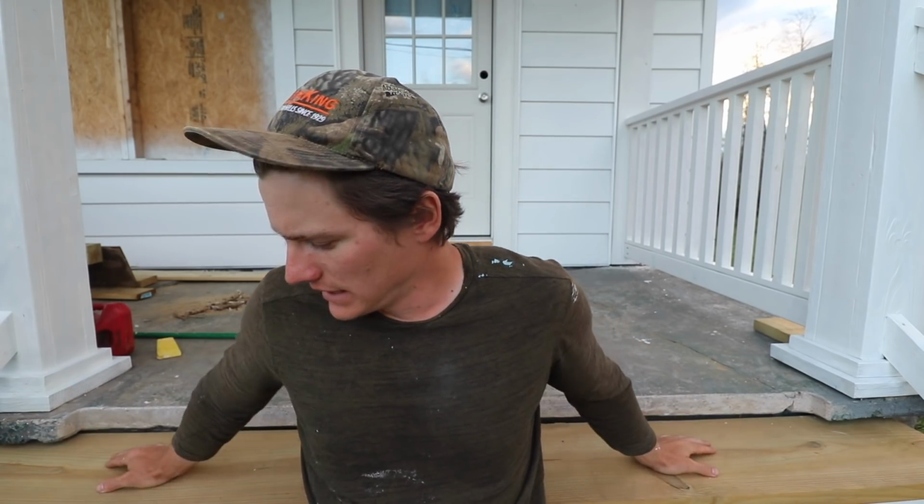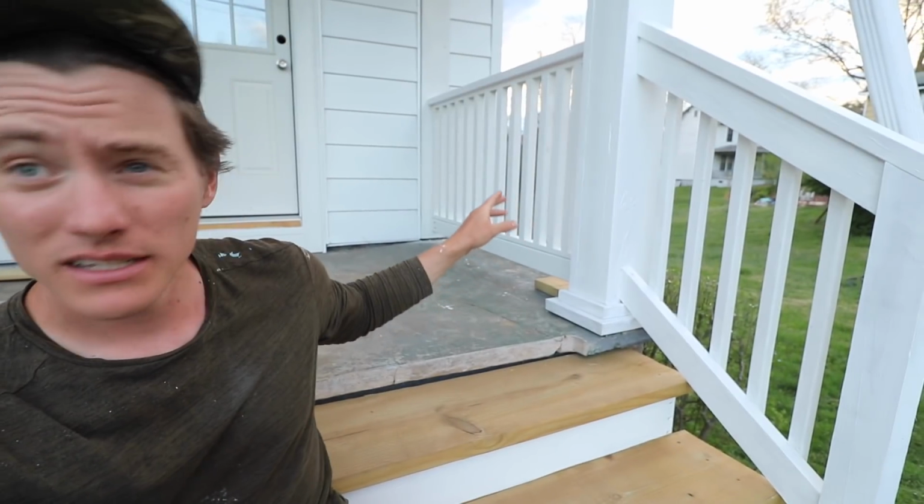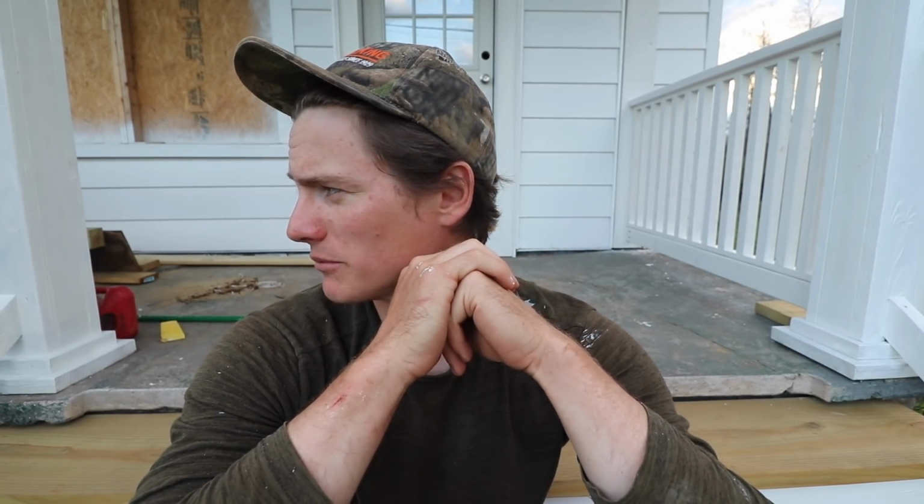Other things I'm going to do is probably put some sort of a stain on the steps themselves, so the kicks are white. And of course that stuff's going to get dirty. And then if you look at some of the paint job, you'll kind of see that it's a thin coat, but it's a solid stain. It doesn't require primer and all that. It just goes on bare wood. So I'm probably not going to actually paint that twice, because this is going to end up getting painted again, and I don't want to just build up endless coats of paint. So it looks decent for now, so I think I'll go with that. And then the next time it gets painted, it's going to look even better.